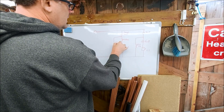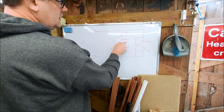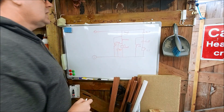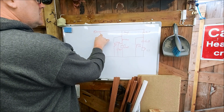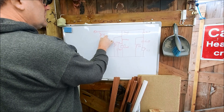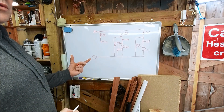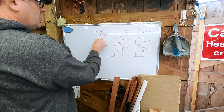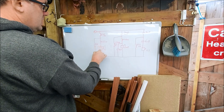Grounding that capacitor with a 2.2 millihenry inductor creates the second-order part of the high pass. For the low-pass part of the mid-range, we ground on a 6 microfarad capacitor. That's the mid-range circuit on the 44. The woofer circuit is fourth order — a lot of components. We have a big iron-core inductor, I think 3.2 or 3.5 millihenry, then a 2.2 millihenry — both iron core, though air-core versions exist too — into the big 12-inch woofer, with each inductor grounded by a 72 microfarad capacitor.